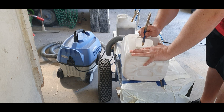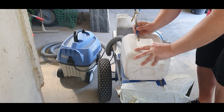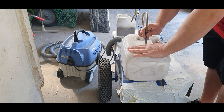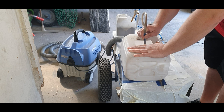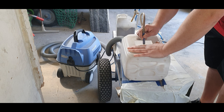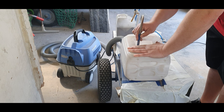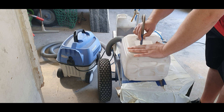You can see when I sandblast line by line, the distance is about six to eight inches, which is about 15 to 25 centimeters. That's fully enough. The pressure is four bar and this little pen really does not need a lot of abrasive.